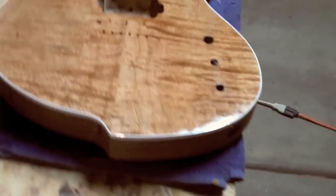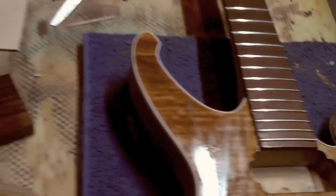This is what the surface of the wood looks like after it has been saturated with the blend of pure tung oil and mineral spirits. I will let it sit like this for about 30 minutes to soak in and then I will wipe off the excess.